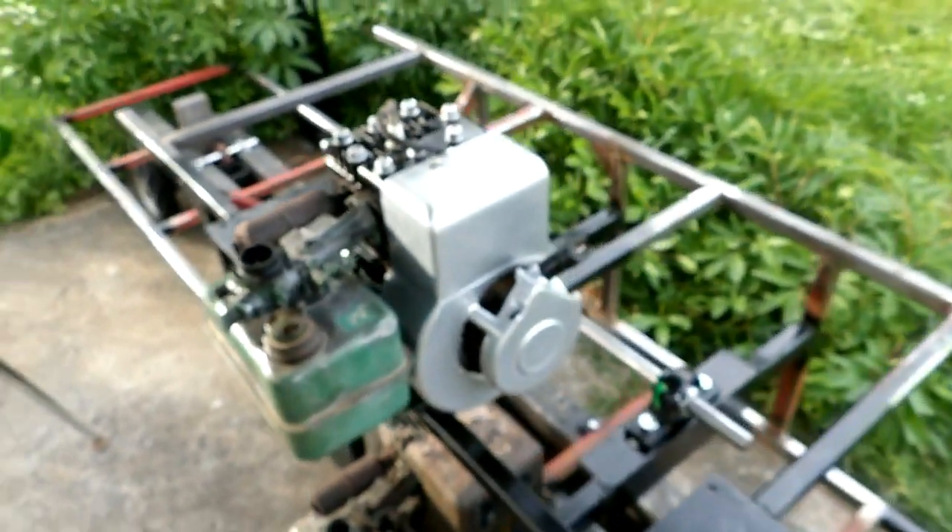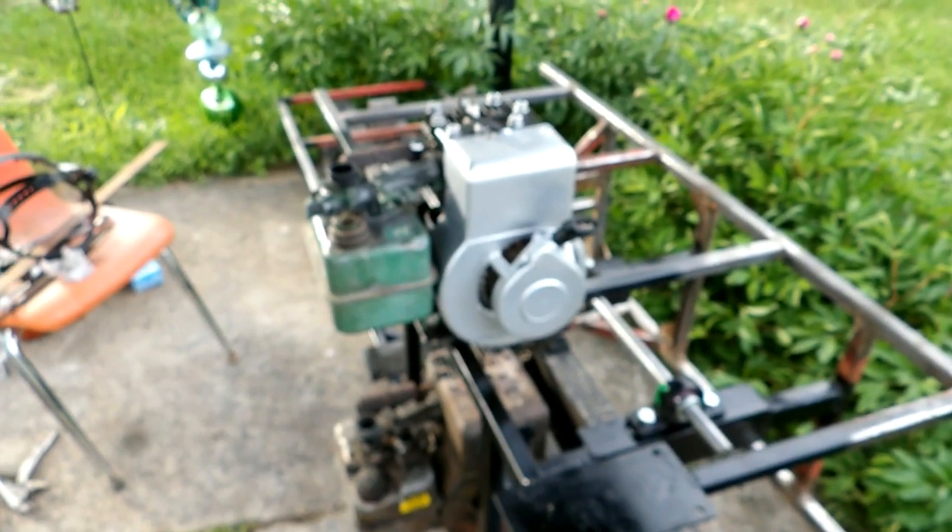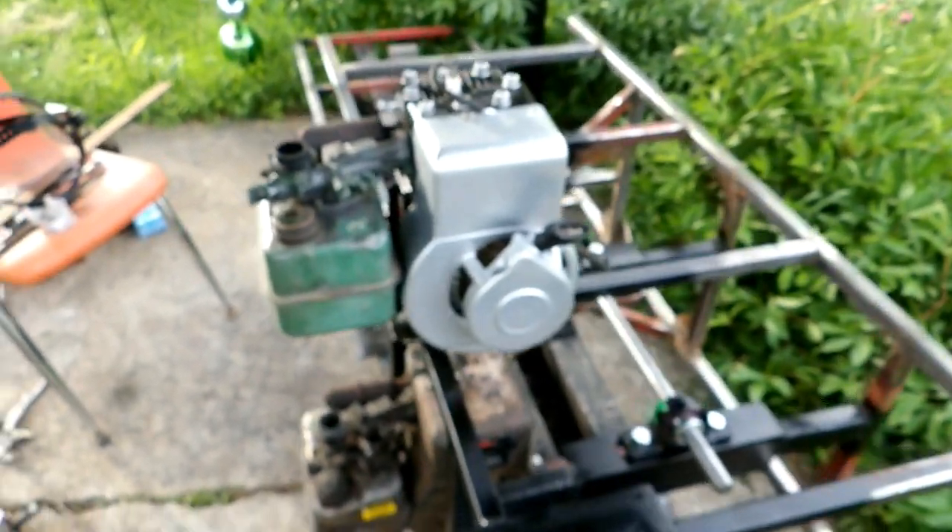Lots of little things to work out, but at least I got something major done this week - I got the two engines chained up and running. A little bit of excitement there. I didn't exactly like running past it but I didn't have much choice - I had to get to my shutoff screwdrivers, that's why I had to shut the camera off. I shut the bottom one down first and the top one - I thought the governor spring was disconnected, but it lugged right down dragging the dead engine.